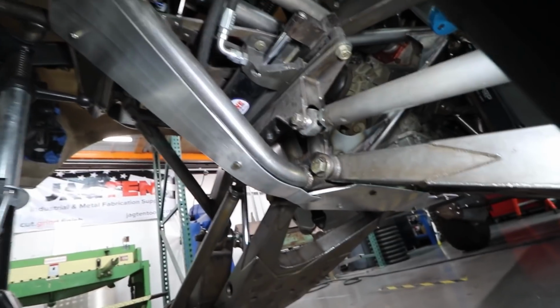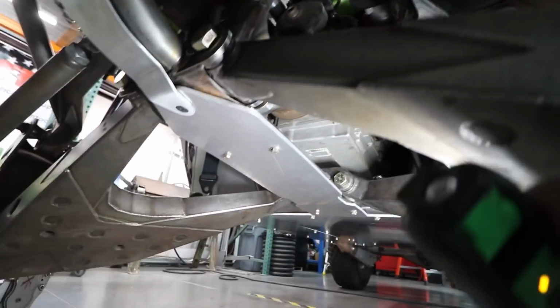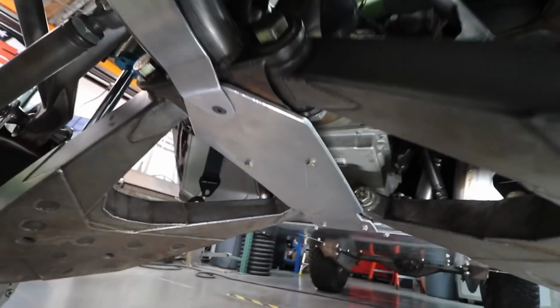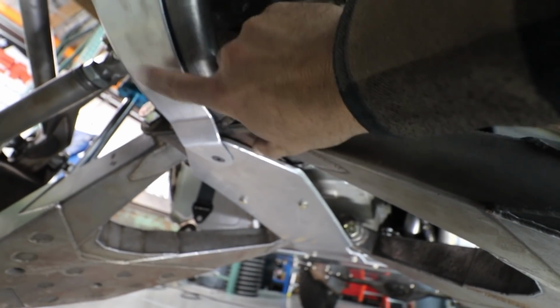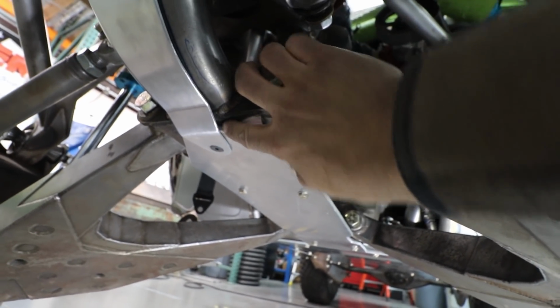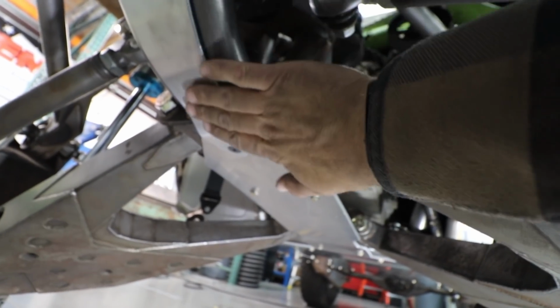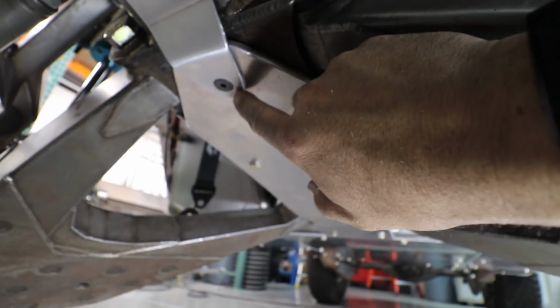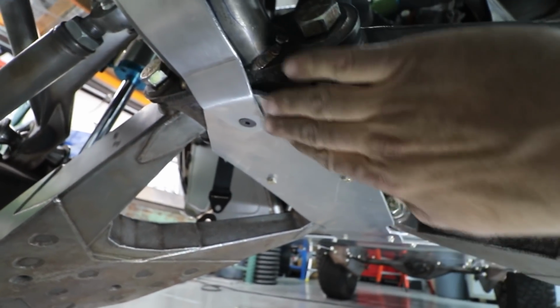So obviously there's that trim piece that's your skid, which I don't think you're going to use too much. And then I also got a protective skid where your pivots are. So that's all 1/4. This thing is wrapped here. So the skid comes down. If you ran this front skid plate right to that skid, there's a chance that this can peel off or start hitting, so it actually goes and then it runs over. And then I used a countersink bolt because this place right here might have a lot of wear and tear from bottoming out and hitting stuff.